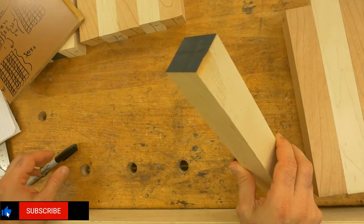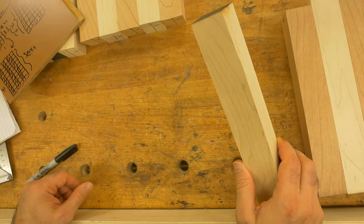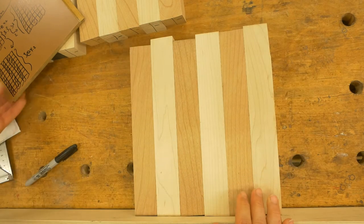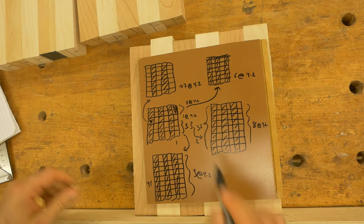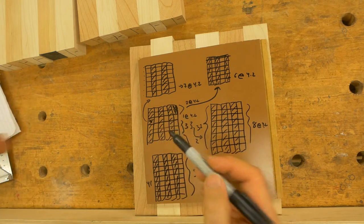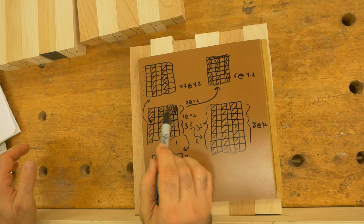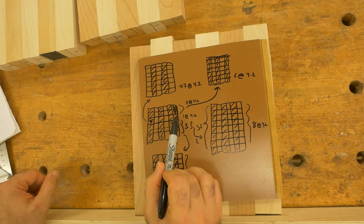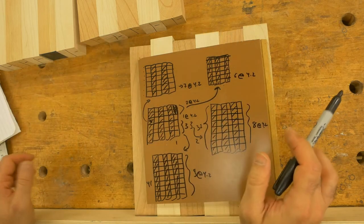When I was inspecting the wood, I found a piece that has a missing sliver right here, and I couldn't properly repair it. Then the idea dawned on me — what if I glue 6? The missing piece is right here, and when we go to our cheat floorboard and draw the sequence, with this being the missing piece, I'm thinking: what if I cut away the maple piece? That's going to give me the two missing cherry-to-cherry strips I need. And the next strip I cut, I can simply cut away the cherry, and that's going to give me the maple-to-maple piece that I'm missing.